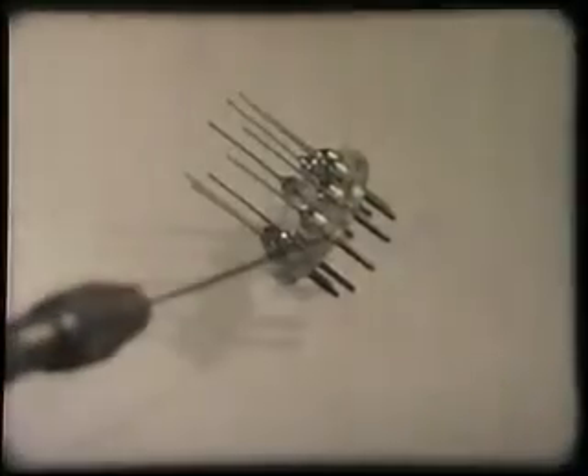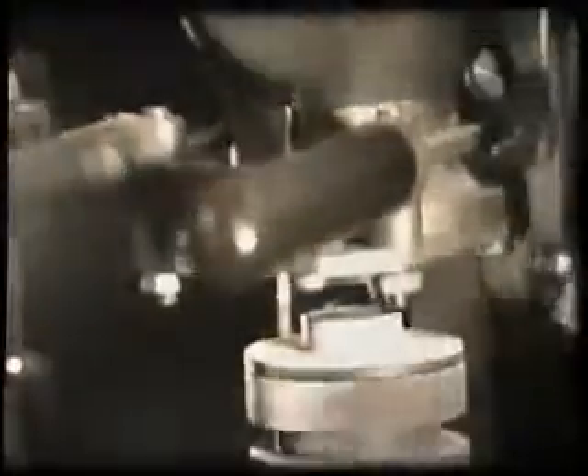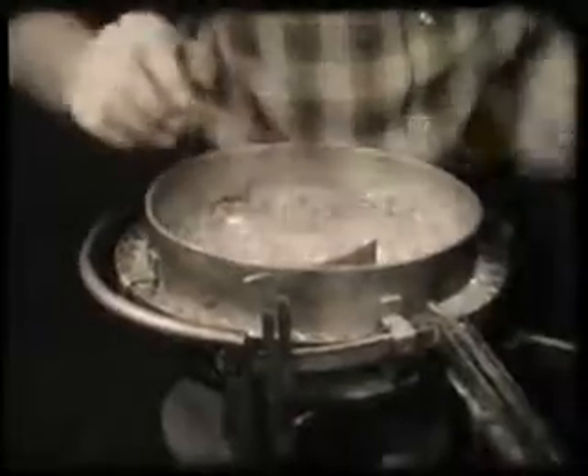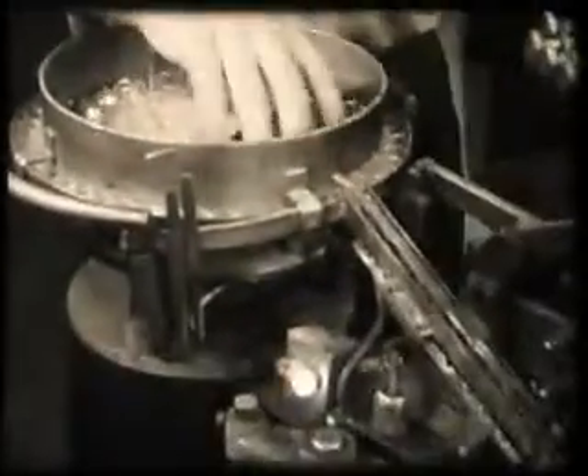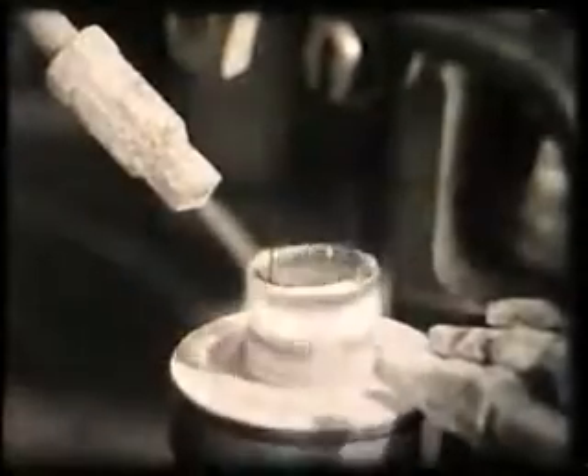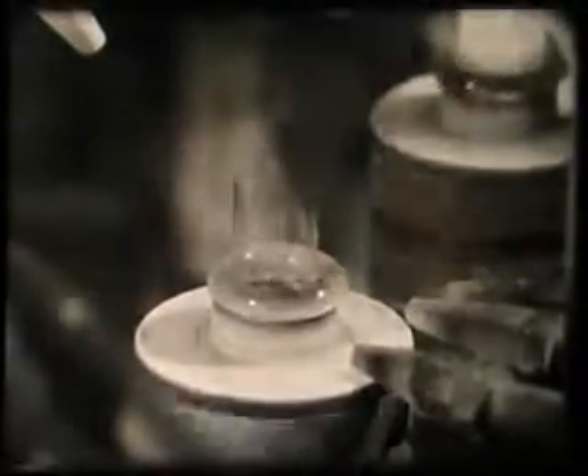It consists of a circular glass pressing through which pass the metal pins, which will be used later for the electrical connections. The bases are made on this type of machine, the pins being automatically fed from a hopper into the moulding head. At the next position, a glass ring called a bead is fed from a hopper and placed round the pins. The head moves through a series of burners and the glass becomes softened.